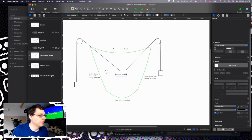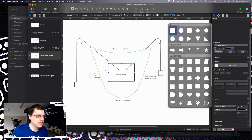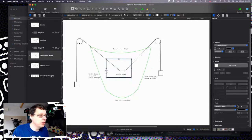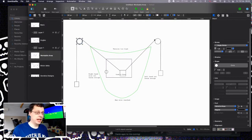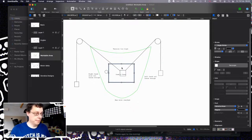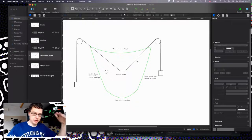So the workable area ends up somewhere in the middle. At the bottom the wires are just too long and the gondola jams. You've got a maximum usable area in the center. The answer is: if you're trying to draw an A4 sheet, as long as you've built the machine bigger than A4 you're fine. If you want to draw A3 or A1, just make the motors further apart and higher up. Make your machine as big as you can. From my practical experiments, about a third of the total area is actually usable — maybe a half if you push it.